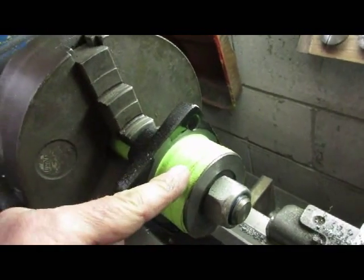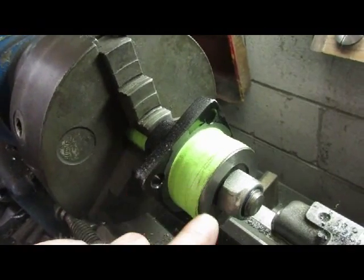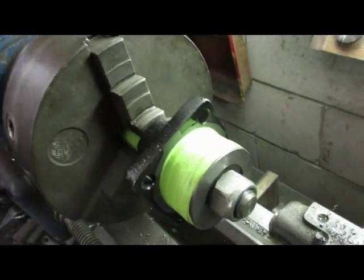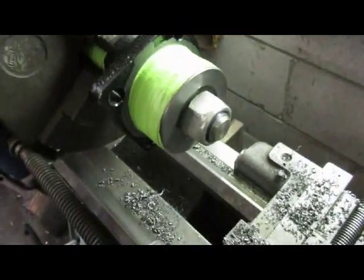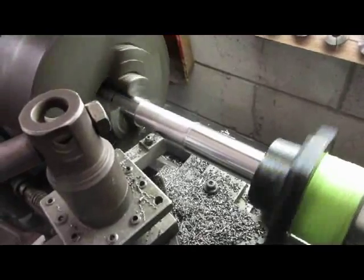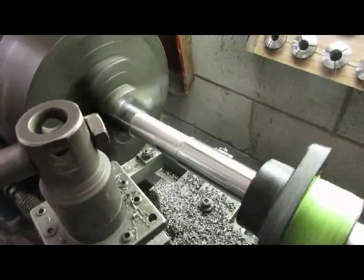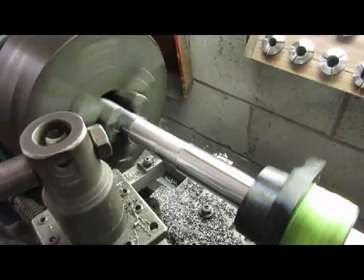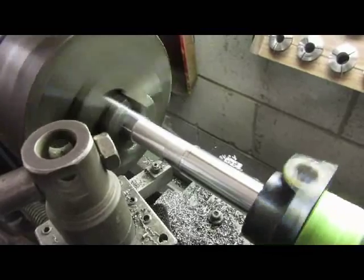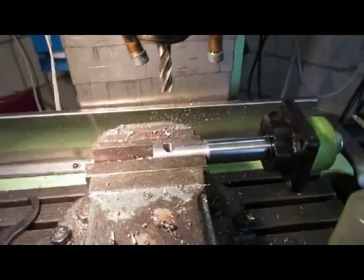Since the piston does all the heavy lifting on the opposite side, it was quite long in the cylinder. The overall piston was an inch thick — I brought it down to three quarters of an inch off the backside. I'm just reducing the size of the shaft so it can go into the socket or between the webs on the snow blower. Once I get it down to one inch, I'll cut it off and bore a hole in it for the pin.